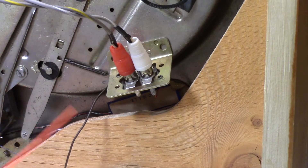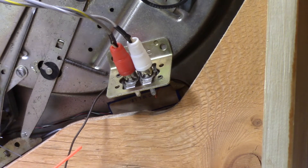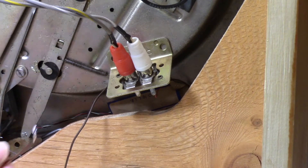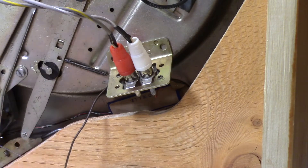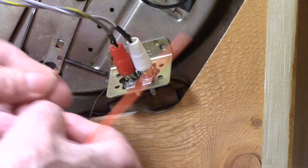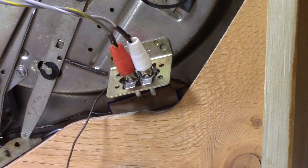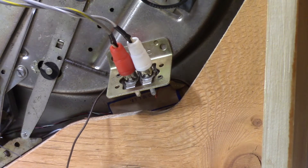The first thing I tried was I took a wire, soldered it to the ground, unscrewed a screw and stuck it underneath there — basically grounded the RCA jack board to the chassis. And that reduced the hum somewhat, but there was still a little bit of hum and a kind of static noise. It was just enough to be annoying.